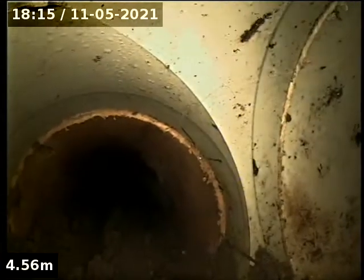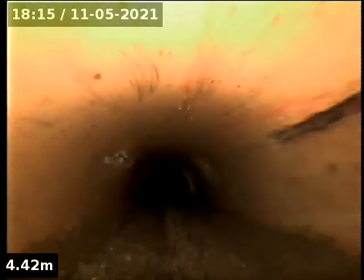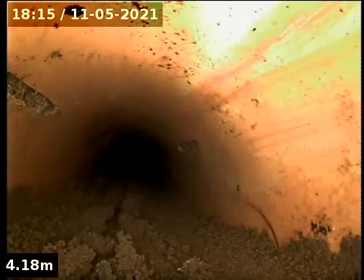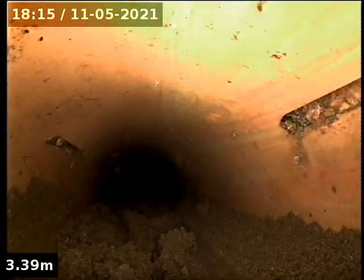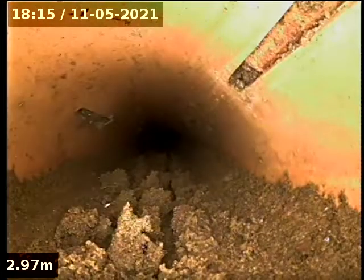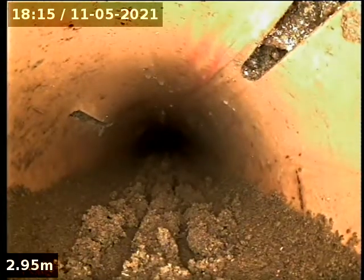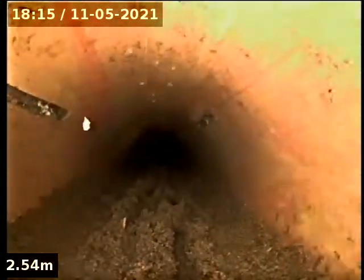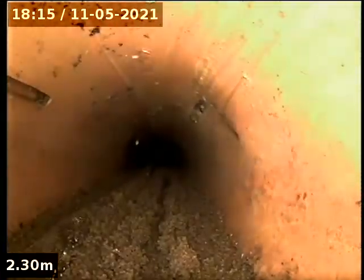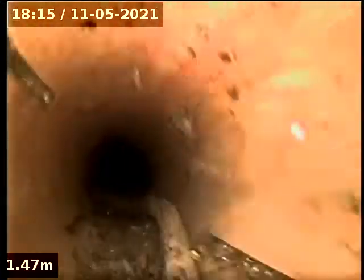And this PVC — there's a junction. More slotted. That could cause a problem if you're using that as a stormwater pipe — it'll let it leak into the ground. Where was that junction? I think maybe it was here. There's no down pipe there — probably it was here. So nothing live to it at the moment.